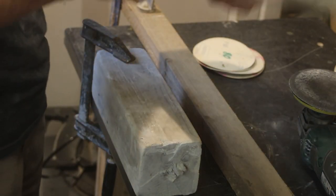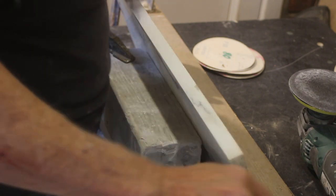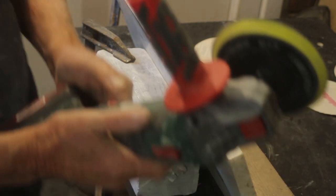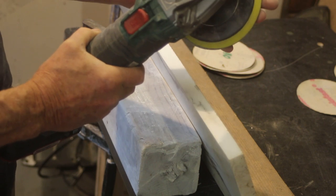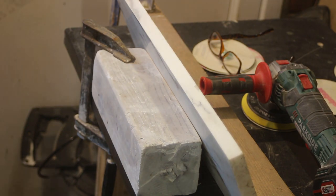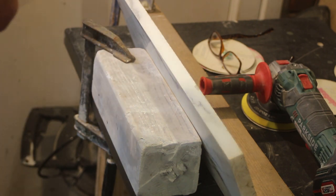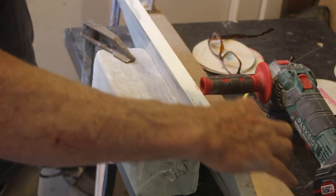The first thing I'm going to do is turn the marble over — polish face down — and just take the arris off this back edge so it's got a nice clean edge. We're going to start on speed 4 on the speed dial. I always wear glasses as eye protection, and because we're going to do this dry, we're going to wear a good respirator and I'm going to open the door of the workshop. The first job is to take an arris — a small chamfer — off the back edge to neaten it up.